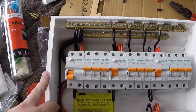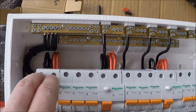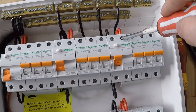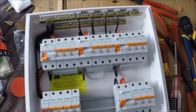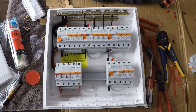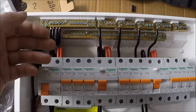A couple of important things: make sure your copper is flush with the top of the breaker so it's barely visible. Also, once you're done manipulating cables — especially if there are two in one terminal — go around and re-tighten them, because cables put in at different angles may not have clamped down flat and can come loose when manipulated. So just go around and check it all again. That's how to set up a switchboard to install. In the next video I'll be removing the old one and throwing this new one in.